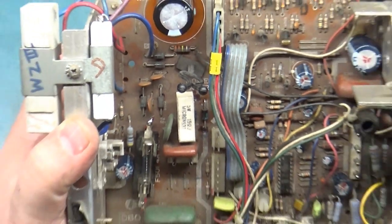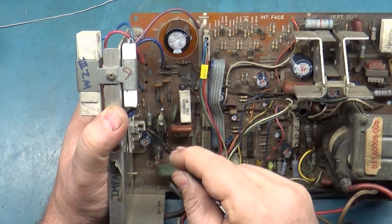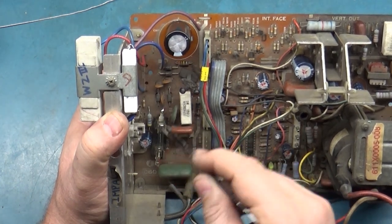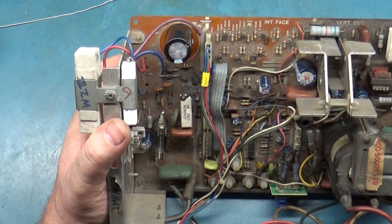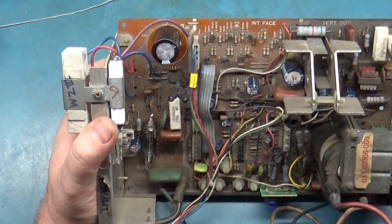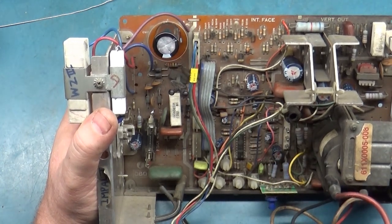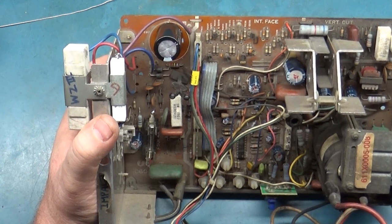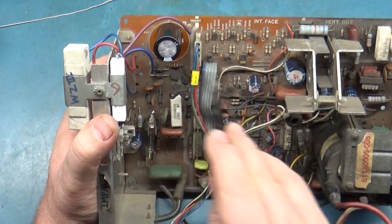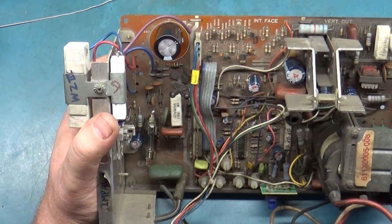But we've tested and double tested. We don't have any shorted components in this circuit. I didn't find any. We didn't have any shorted or open components in this circuit over here. None of this would cause the voltage regulator to short. The HOT and critical safety cap are good. So it has to either be the filter cap, these caps that had the bad legs, or the flyback. That's all it could be.